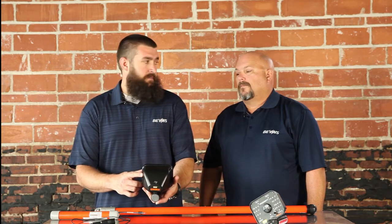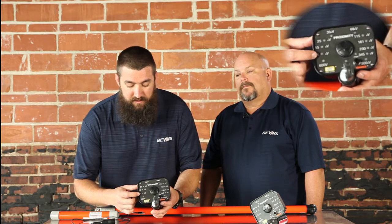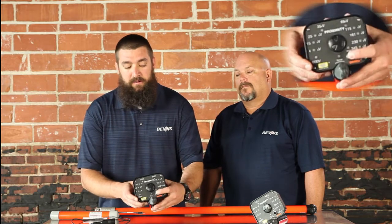We're powered up. We should go ahead and test to make sure that the unit is functioning properly. We're going to use our external tester-tester device and plug it into the unit. It will inject a signal and basically simulate a high voltage source and cause the unit to display a reading. So when we plug it in, in this particular case, we should see either the 4 or the 15 kV light — somewhere in that range.